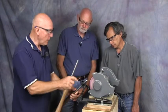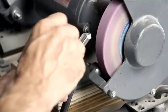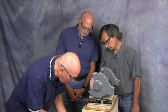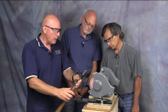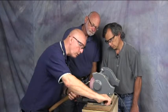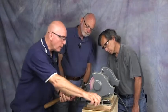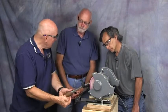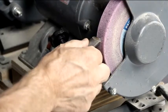Would you still be able to use this system with that blunter tool? Yes. I'll take this tool out and put that one in to show what we need to do. I'm going to slide this out, measure the length, and get that set so I have a uniform distance again. Now I need to move the slide arm because the bevel angle is much blunter — to get the bevel across the bottom of your bowl. I'll slide this out until the bevel is laying right on the wheel and lock it. So to get a blunter angle you slide the arm out, which moves the tool down and makes it more blunt on the end — and it lays right on the wheel just fine.